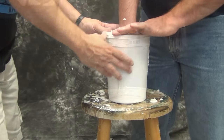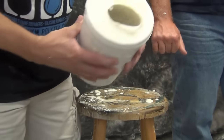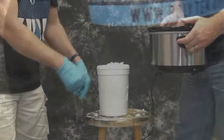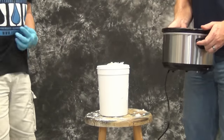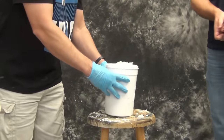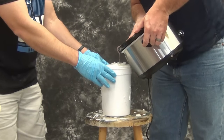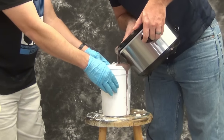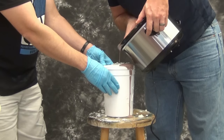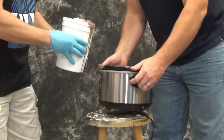To begin, we'll be pouring up a copy of Tim's hand into an alginate mold. One of the important things to remember when pouring MonsterClay into an alginate mold is it's real important to keep the temperature below boiling — below 212 degrees. If you exceed that, you'll find that you get a lot of air bubbles and distortions in your cast. So it's a good idea to use a thermometer to check that and make sure you're below 212°F.